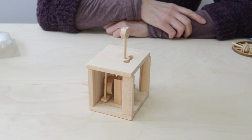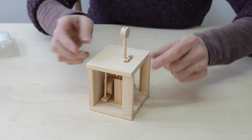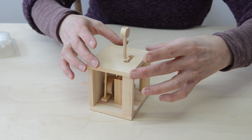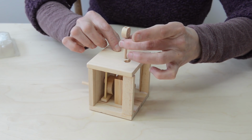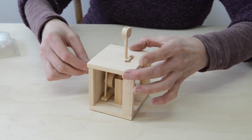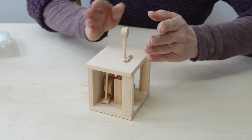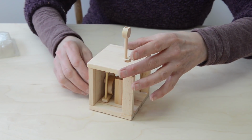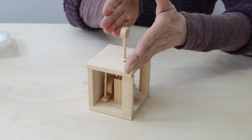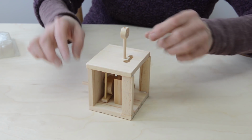So on page 9, when you put the lid on, as you can see I've got a slight lip there and a slight overhang there. I don't want to force the lid. The most important thing is to get this vertical. So put the lid where it's happiest to keep this vertical. Don't force that to lean. And also remember that when you glue that on, it must be parallel to the edge when the handle is in the down position and the cam's in the down position.